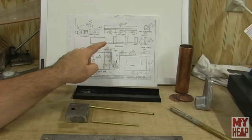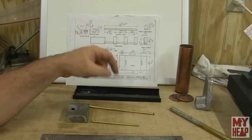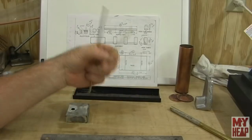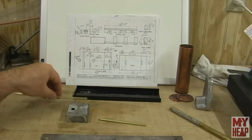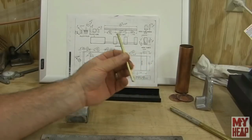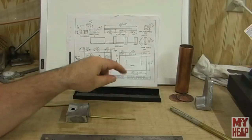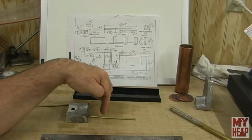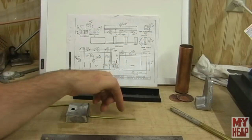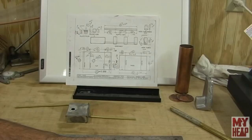And then the supply pipe is 3/16 OD brass, and I had a length of that, so I've cut a piece off at 112 millimeters. So we'll use this. This will get soldered into the tank. Filler tubes will get soldered onto here, and then some little bases on the bottom to close it all up. So let's get started.